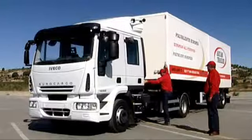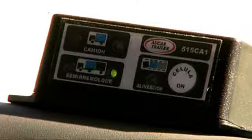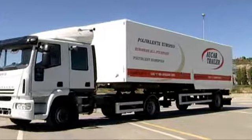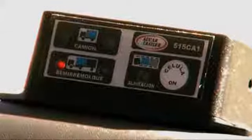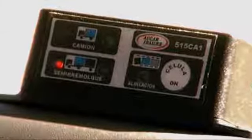Again, the automatic process connecting the box to the semi-trailer's chassis is completed by coupling the hoses, unplugging the electrical outlet, turning off the wheel alignment system and, finally, confirming to the instructor that the green light is on, which is a sign that the vehicle can run safely. On the other hand, if any problem is detected when starting to run, the red light of the semi-trailer comes on and the alarm sounds, advising the instructor to stop immediately.